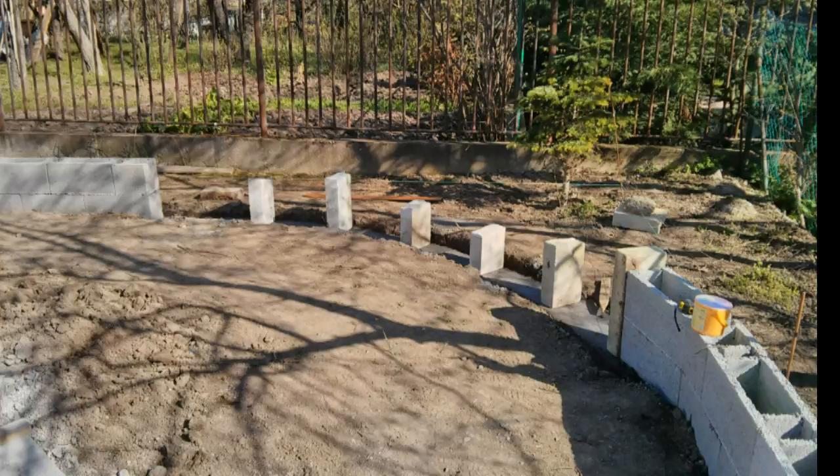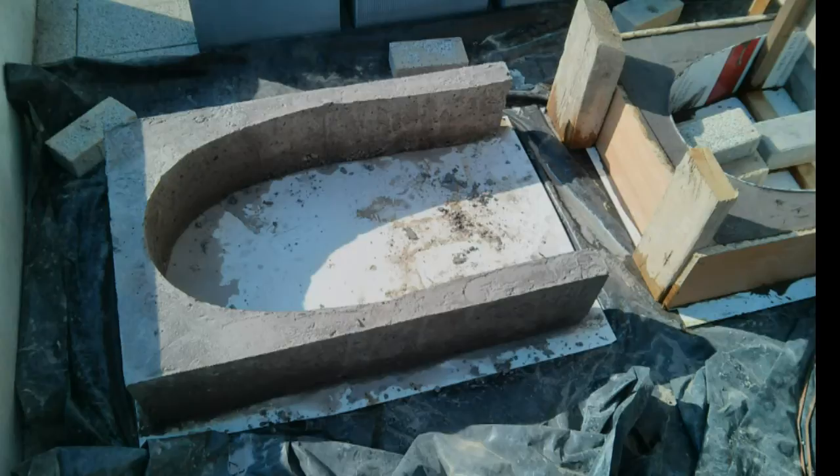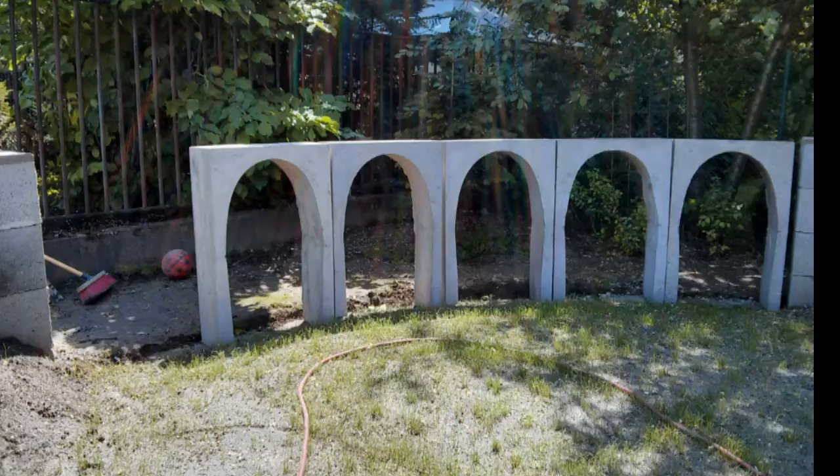Before making the mold, I used blocks to mark the rough placement of the arches to get a feel for how the final structure would look. The concrete mix was done for me by masons who were working in the garden, but the last few arches I mixed myself — and I always overestimate the water needed, so my mixes end up really wet. The first arch came out and the next one was already being poured the next day. The first arch was made from a coarser grout mix, which shows a little. All six were eventually ready, with the last one poured about a week later, hence its darker color. Each arch requires about 50 kilos of concrete.